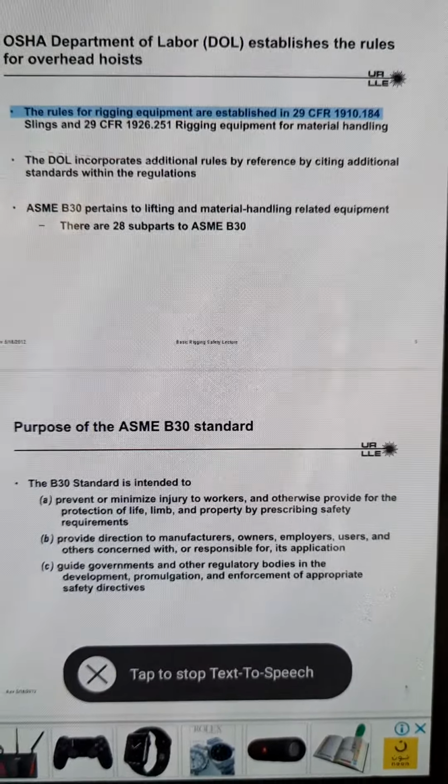Machinery eye bolt use. Visually inspect eye bolt for any damage or corrosion on threads and body. Always be sure threads on the shank and receiving holes are clean. Ensure eye bolt has proper identification markings. Always countersink receiving hole or use washers to seat the shoulder properly. Always screw eye bolt down completely for proper seating. Always tighten nuts securely against the load. When using blind tapped holes, make sure thread engagement is more than 1.5 times the diameter of the thread in steel and 2.5 times in aluminum. Rev. May 18, 2012, Basic